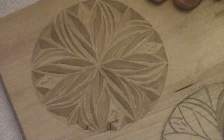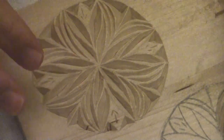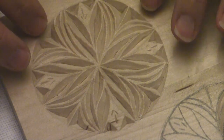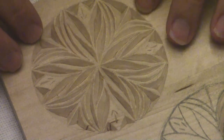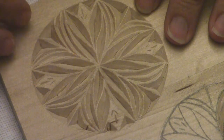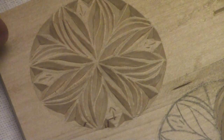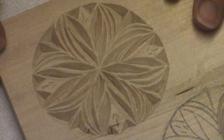You can also choose to stain it, depending on what you're making. It used to be that it was kind of unheard of to stain chip carvings like this. Normally a coat of oil, maybe another coat of oil, does everything you could possibly want to do for it. But as popularity grew to do chip carving on what would be hardwoods, staining became a nice option for basswood when you want it to look like something else. And the same thing goes for butternut.